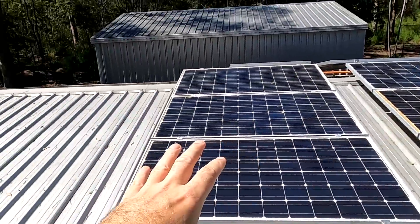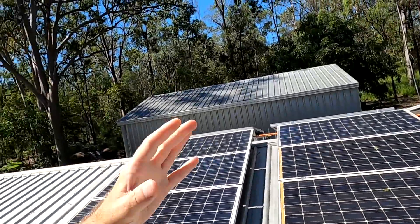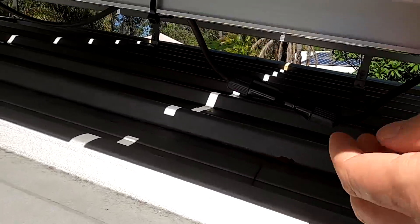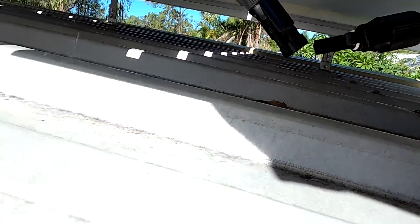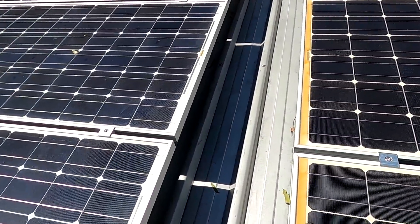This is a 1.7 kilowatt array and this is almost the optimal angle now. They should produce far over 1 kilowatt, but they are producing only half a kilowatt — 650 watts, 700 watts maximum. That is all. I don't know why this is. So what I want to do is disconnect single strings. I know you shouldn't do this under load, but there's almost no load — we're getting only two amps per string. Two amps! That is ridiculous.